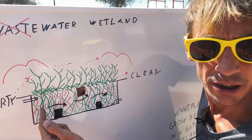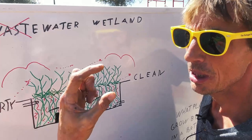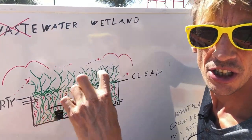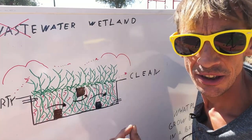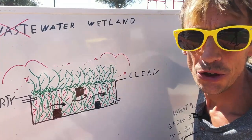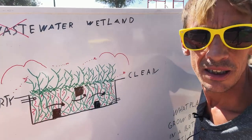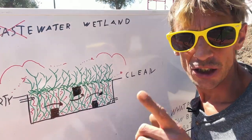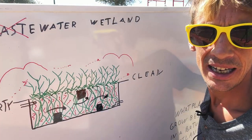And they will be cleaning the water. The water level will not be to the top. The water level will be maybe 5 centimeters under the top, and the last 5 centimeters is fine gravel. So in my opinion, mosquitoes cannot get in there to put their eggs in the water. Also, there will not be much smell from the standing water because it's covered. Maybe it's a little bit more clear now. So unless you think that mosquitoes can go through gravel to lay their eggs, I don't see the problem.